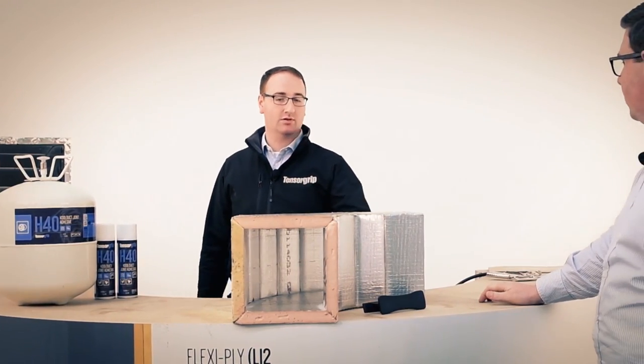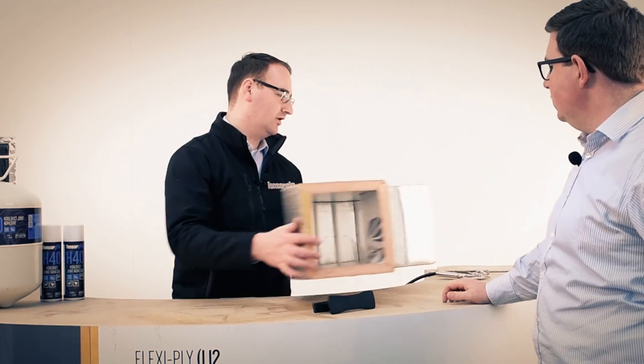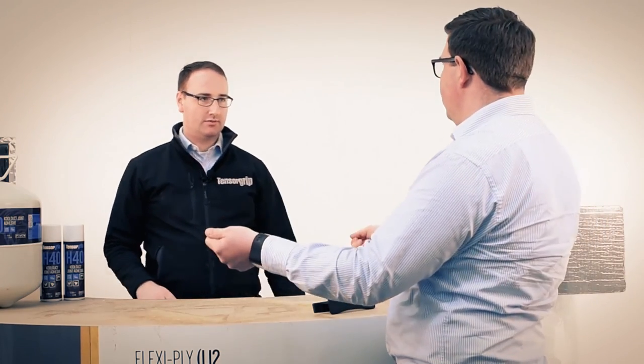Does that tell everybody what we want them to know if you are actually making a successful curve and using exactly the same process? What you're saying is use exactly the same process, even if we're doing a square duct. So even on a straight duct, Carl. On a straight section, typically, you've got the pieces out flat, and the delivery partners have got the tooling for cutting V-grooves. So essentially, you've got one flat panel with a series of V-grooves in it, and you're just folding it up. So you're spraying the V-grooves along the way. So it's not cut right through the foil? No. Basically, the V-groove goes into it, and it kind of moves, and then you spray the joint. You fold it around the four sides, and you spray all the V-grooves and the final two faces to bring them together.